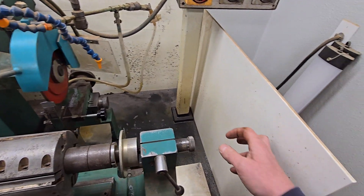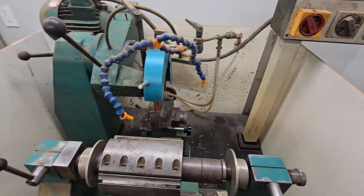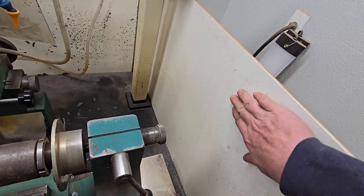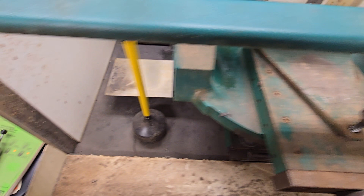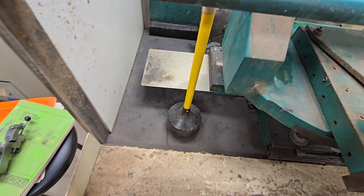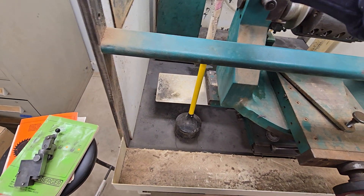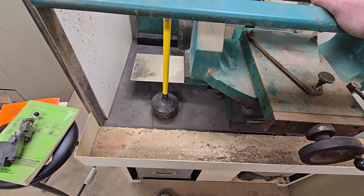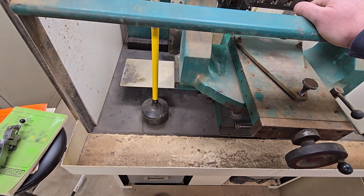We have modified it. It's got water shields on the two sides and the back — they're just plastic and anything on them basically wipes right off. We redid the bottom pan and that is a rhino lining. I added a magnet to catch some of the filings before they go down into the tank, which helps extend your fluids before they need to be changed.